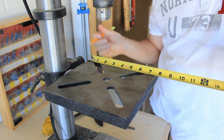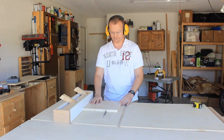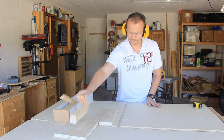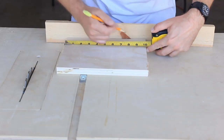I want to cut the base piece first, so I'm going to add half an inch to this measurement. I'll adjust the fence with my alignment jig. Now I want to do the same thing for this measurement at half an inch, so I'll switch to the miter gauge, mark out the measurement, and make my cut.